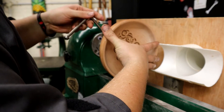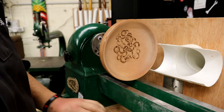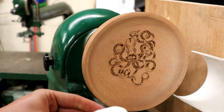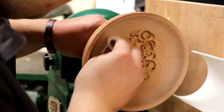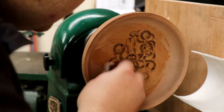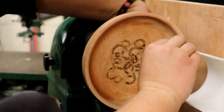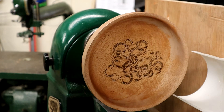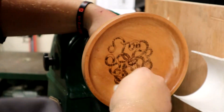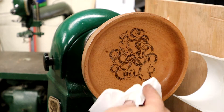After all this, I'm going to chuck it back into the lathe. This was unfinished, which was a bit new for me — I wasn't sure how it was going to work. Off camera I blew everything off, because you do get a burnt residue from the laser, so just be sure to blow it off and make sure it's not going to smudge. I'm just going to be repeating what I did on the outside — three levels of Chestnut sanding sealer, then finishing off with three layers of Hampshire Sheen.